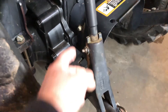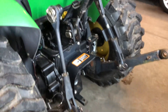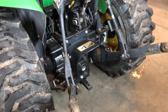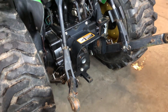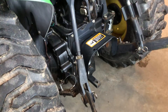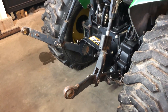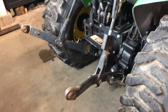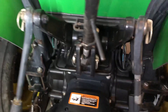The other adjustment requires a bit more work — you actually have to pull off the link and adjust it by hand. These all have grease fittings too, by the way. You want to keep these greased because once the fitting gets dry, you're left with metal on metal. That's not a big deal when there's nothing on there, but if you put a bush hog on it that weighs a thousand to two thousand pounds, it's going to wear out the fittings.